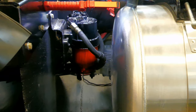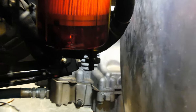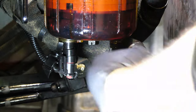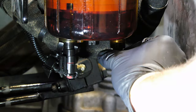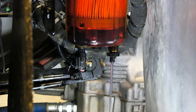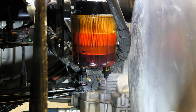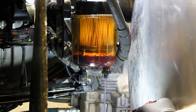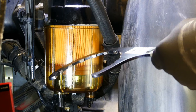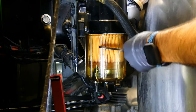If you happen to have the PACCAR chassis filter, it's very similar to the DAVCO's just turned upside down. In order to drain this bowl you'll need to find the drain valve located at the bottom and then turn it lefty loosey to get the fuel to drain out. With this style you're going to want to drain the bowl completely before removal. The PACCAR style chassis filters need their own filter wrench as well. You can find these on Amazon for around $20 or so. No channel locks, as they can cause the fuel bowl to crack.